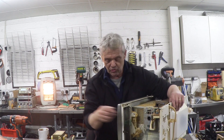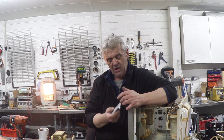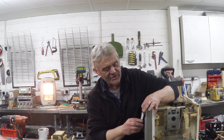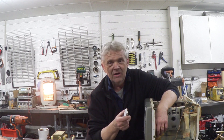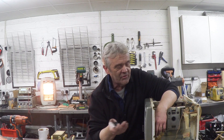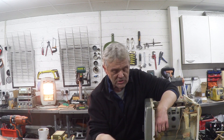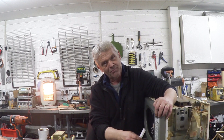To do that I've got these inline slimline standard fittings — you can buy these at your big-box store. I went down to B&Q and bought these for 50p each. One will turn on the motor and the other will turn on the LED lights. They're rated for the voltage, extremely cheap, and it makes the whole thing plug and play. All we're going to do is wire the motor into one switch and the UV LED lights into the other, the same way you'd wire a house switch. I just need to cut the front bezel a little bit and drill it out to put some bolts through.